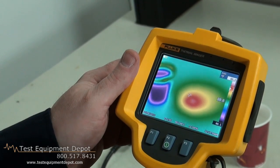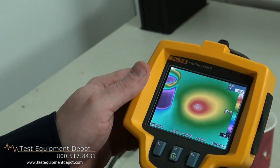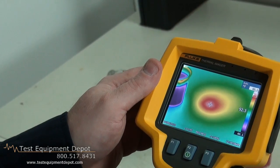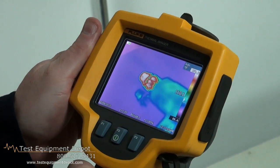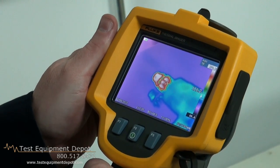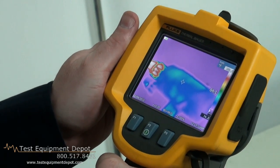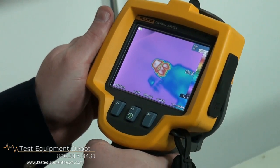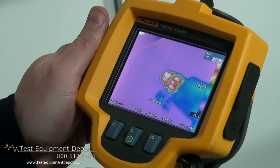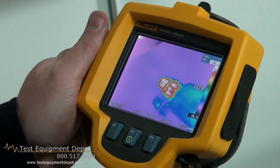Calibrate this, focus it, and you can tell the exact temperature of where the heat gun was shooting on the table. You can see the heat source on this heat gun after approximately one minute of activity. The body of the heat gun is roughly at room temperature, slightly warmer, but the tip is now in excess of 140 degrees — approaching closer to 160 degrees.